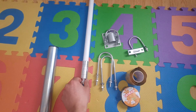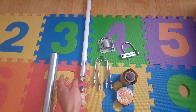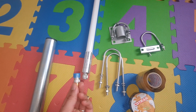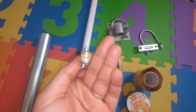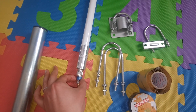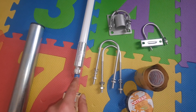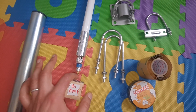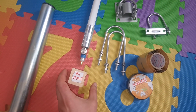I will use the 9dBi McGill antenna. This is at my host's home — this is the rack just for demonstration. Cut your antenna cable, use the connector — this is N-type male to SMA male. Connect it to the antenna and make it a very snug fit. From the SMA male you need the bidirectional amplifier because you have SMA female to SMA female connectors.